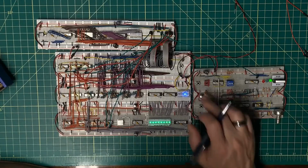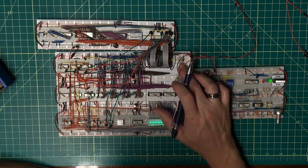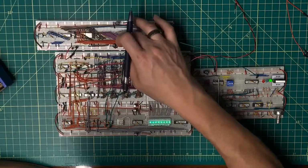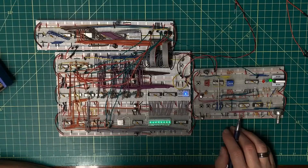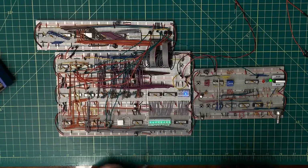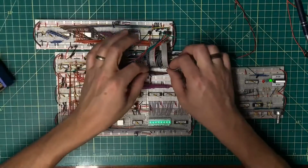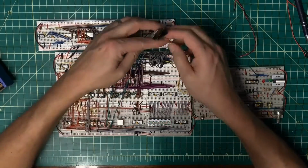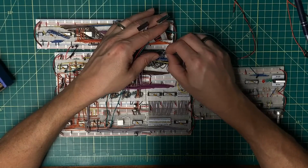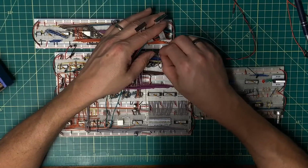Okay, let's turn that up as fast as it can go and hit the reset button and see what happens here. Absolutely nothing up here. But is that a problem? I'm not feeling anything hot. It's more than likely this value has zeros here. So I believe it's 1, which is of course buried under all of this. I believe it's the value or address 1 or 2 that has something in it for this EEPROM. So let me program this to be 2 and see if I can't get at least something out.